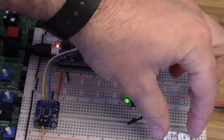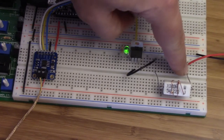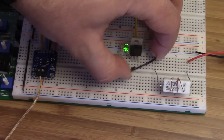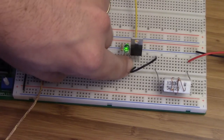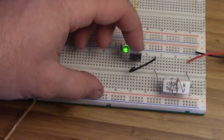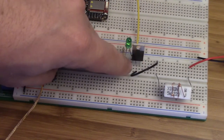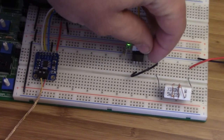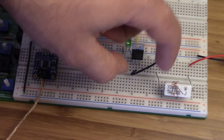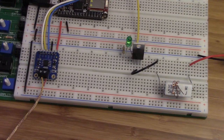The connection of the heating element is that I have my 9-volt power supply coming in. The positive lead goes to the right side of the resistor. The left side goes over to this black wire, which goes to the middle pin of the transistor, which is the drain. The third pin is the source, and behind it that's going to ground. When we apply 3.3 volts to the gate, the transistor connects the drain and source together so current can flow through the resistor to ground, and back out the negative lead of the power supply.